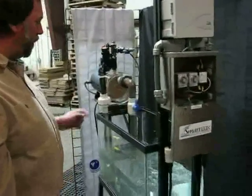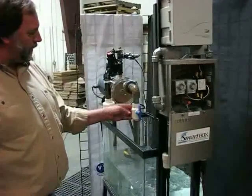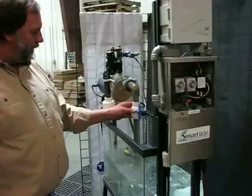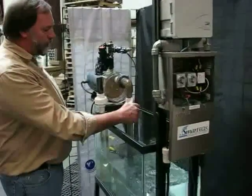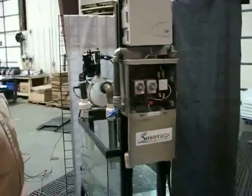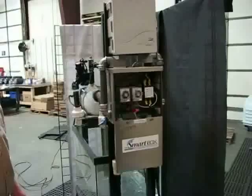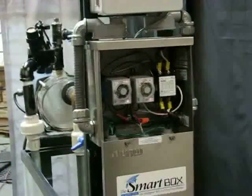Now the smart box represents here the suction inlet to the pump. If the water source is shut off, then the pressure drops below 20 pounds, which is timed out by the timers, and the pump will shut off.